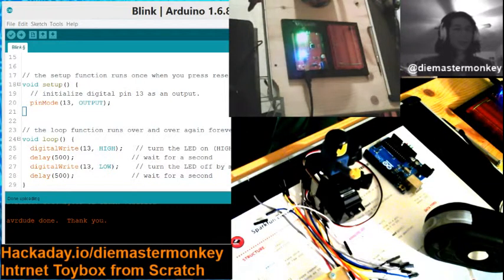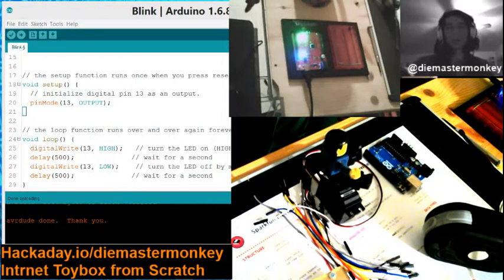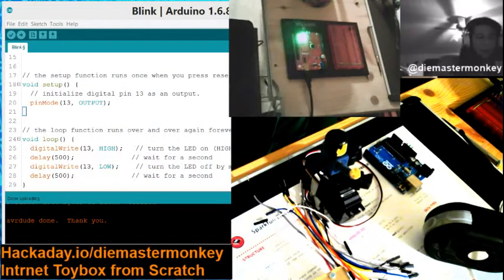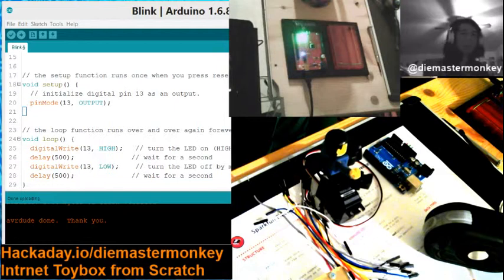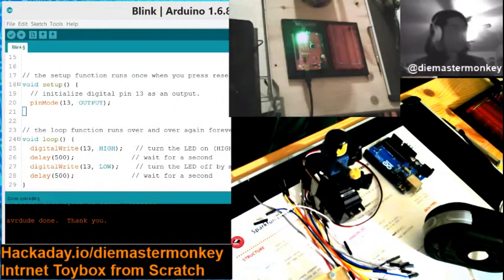Okay, so before the break, we had attempted to upload that code to the new Red Board. However, that didn't work out, and here's why. I found out exactly what was up with that. Took me a while to install Windows stuff, as you imagine. It was FTDI drivers. I had updated those at some point, and I hadn't updated Arduino, which meant that the AVR tools hadn't been updated. Anyway, the setup was a mess there. So I got that handled, and now I've rebooted.